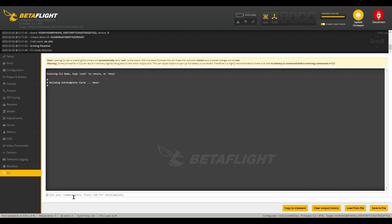And in Betaflight, the first thing we need to do is free up that RX5 resource and the pin that it's currently attached to. So you're going to type in resource serial_RX5 none, and that will take care of that D02 pad.